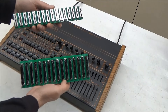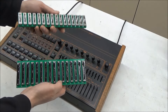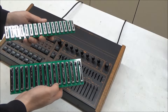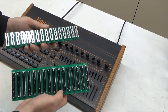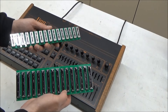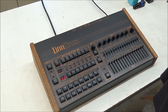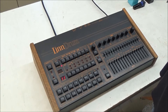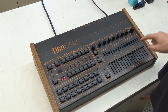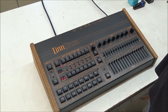I've made two different sets of replacement sliders for the Linn drum. First up are the non-illuminated sliders - one assembly for the volume sliders and another for the panning sliders. Having them on a single assembly ensures they're all perfectly parallel once installed, unlike some fiddly adapters I've seen people selling for other synthesizers. Here's the non-illuminated slider set installed in my Linn drum. The slider heights are the same as the originals and they fit the original slider caps. From the outside it's hard to tell these aren't original, but we saved a ton of time and we have brand new high-quality sliders in there now.